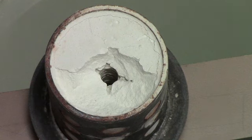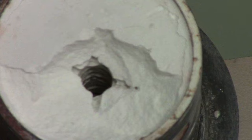Okay, I thought I'd get a close-up of the flask that the bottom got sucked out of and busted. If you look real close, down the center hole was the main sprue that all the wax components were attached to. And what you see is little channels coming in. That's where the waxes were attached to that center sprue. As you pour the molten metal in from the bottom of the flask, the atmospheric pressure, because the flask is under vacuum, pushes the molten metal into these little cavities that radiate off of the center sprue. It's not vacuum that's actually pulling the metal in, it's the atmospheric pressure.